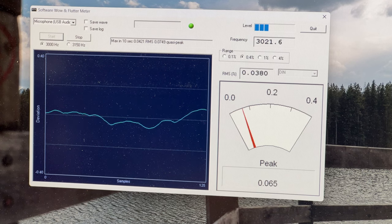Excuse me, I can't clear my throat today. Anyway, the chip this deck uses, well, actually, there's more than one. There's four of them, is the NE650. So we get the measurement at pin 3, and we look for 549 millivolts here. And JVC, being awesome as they are in this deck, has provided us with actual test points at those pins. You can see I've got the scope hooked up to them right now. And the adjustments for these are right there and right up there. So this is going to be easy, I think.